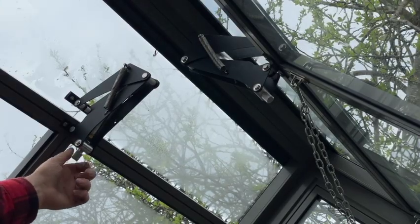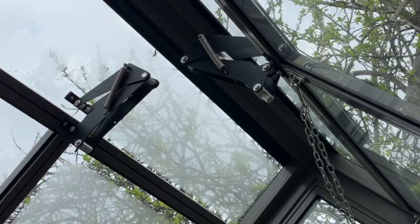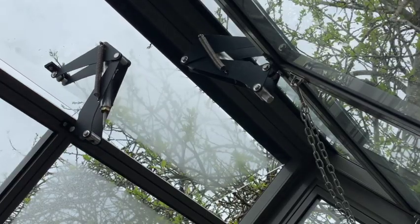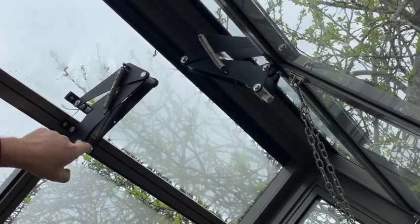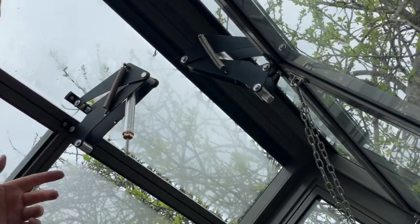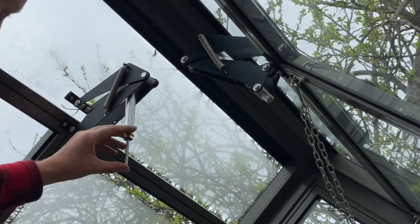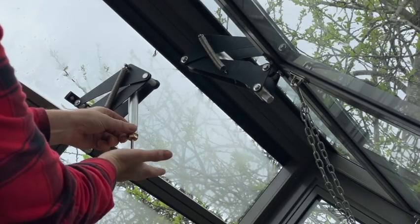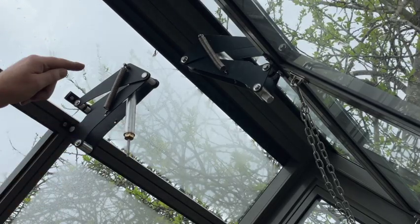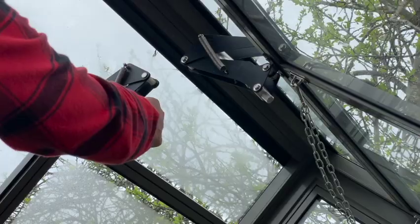To reset your auto vent, you are best off removing that adjuster. Be very careful to keep your fingers away from these arms, because you have got the weight and the force of those springs working against you. What you want to do is try and relocate that piston into the hole. If it's been warm since you noticed it's not open, there's a chance the piston will have pulled down, making it more difficult. With a bit of force — maybe using a book or something hard — try and get that piston in as far as you can. It will be easier when it's cold, like first thing in the morning, as opposed to the middle of the day when the wax may have expanded.